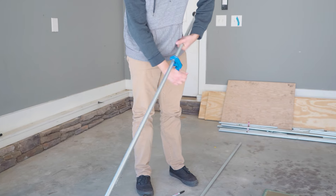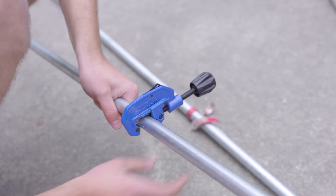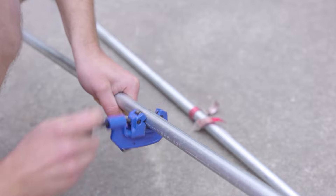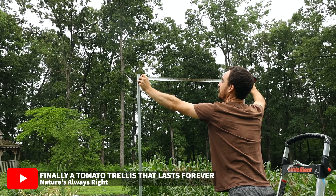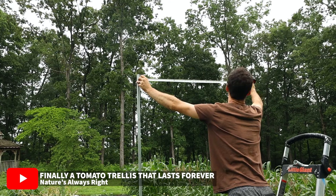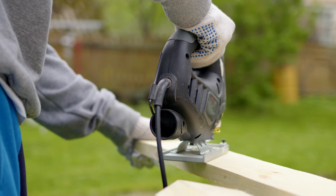The benefit of modularity kind of stems from another benefit, which is the ease of working with conduit and clamps. You don't need any power tools to cut conduit or assemble the connectors. The only special tool that you probably don't already have is a rotating pipe and tube cutter, which is pretty inexpensive and pretty easy to learn how to use. To assemble connections, you only need a 5mm hex wrench. Because neither of these tools require electricity, you can build right in your garden, which makes it much easier to get measurements and build on the fly. They're also very beginner friendly, which is great because you might be intimidated to use other materials like wood because of the tools and skills that are needed.